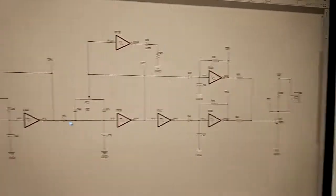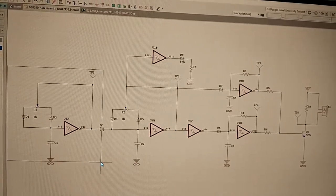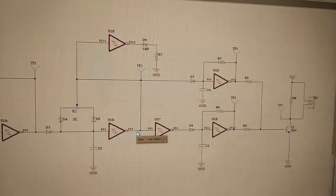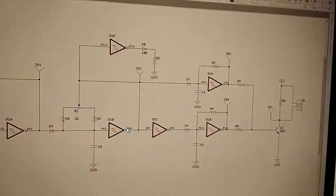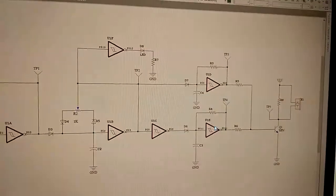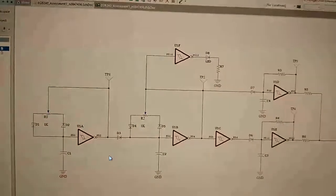So when this oscillator here, that's one oscillator, when its output is high, this Schmitt trigger outputs a low signal, so its output is just pulled low, and therefore it just turns this one on, because this is an inverter, and only this one flies. So this is the low frequency tone oscillator here. And then when this is... I might have got my logic around the wrong way.